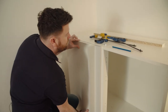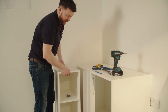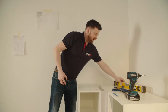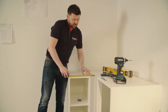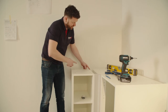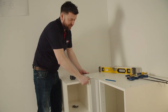We're going to install our blanking panel for the pre-drilled holes. With the blanking cabinet positioned where it will go with the adjoining cabinet, we'll get it leveled up to the line again. At this stage I like to make sure that the cabinets are square to each other — take a measurement. Here we have 60mm, and make sure it's running 60mm through the back as well. Use a bit of scrap wood across the back of the cabinet, secure it, to keep everything square and tight for when you put your worktop on.